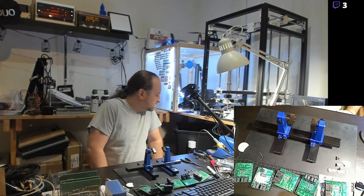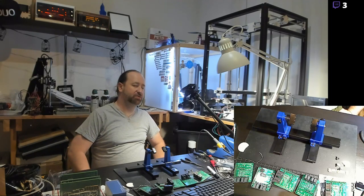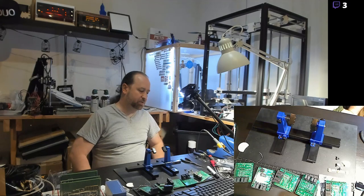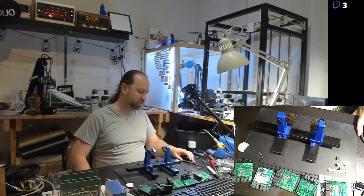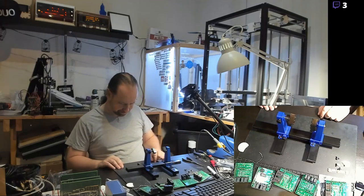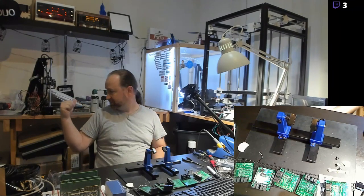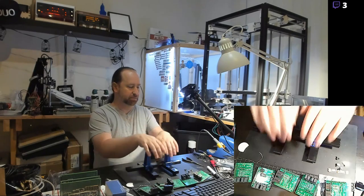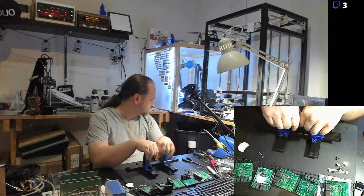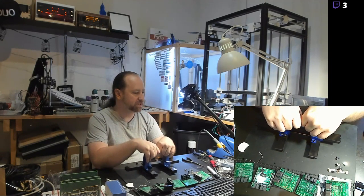Honestly, the board itself is not that bad, other than the fact that the 8825 drivers are soldered on. There are headers for stepper control if you want to use external steppers, but I would have to hack in an interface for the current control module. That seems like an awful lot of work for something I can just replace with the Gen L board without making a huge mess. And yeah, I can run Marlin 2 on it. It's functional, if a little iffy, but that's getting better.